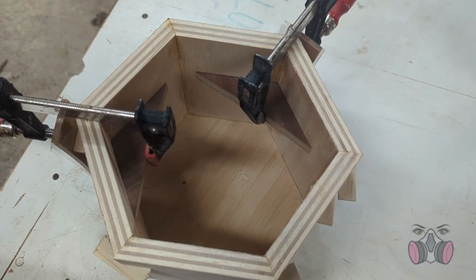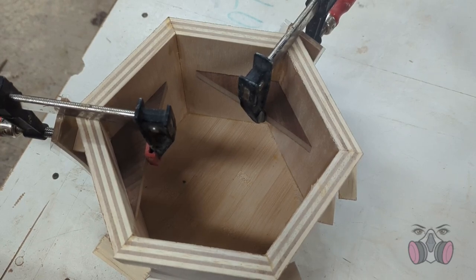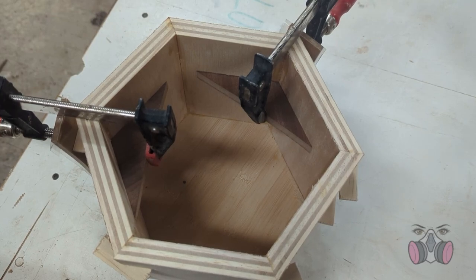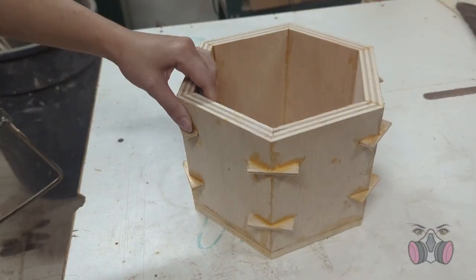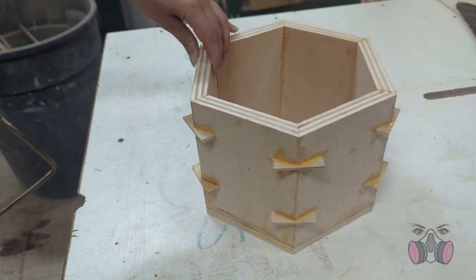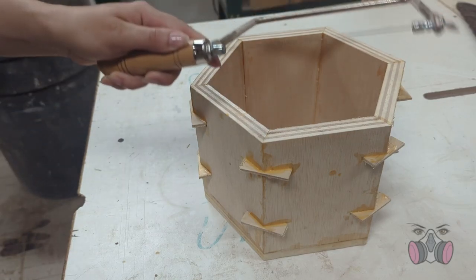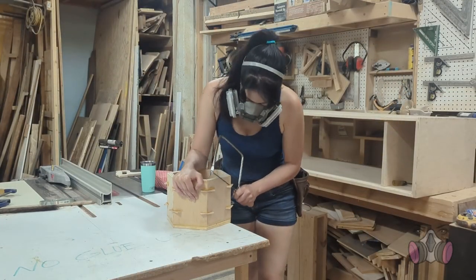To clamp everything down, I went back to the piece I just cut for the jig and cut off those 120 degree corners. Since they were already cut to match the angle of my honeycomb, I knew they would fit perfectly for the joint angles. So I used those to clamp down my spines while they set. I only had two clamps, but I was in the middle of a completely different project on deadline, so swinging by to move the clamps every hour wasn't that big of a deal. Then I cut off the parts that were sticking out with a handsaw.